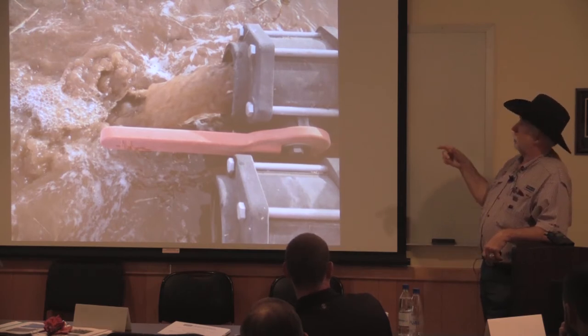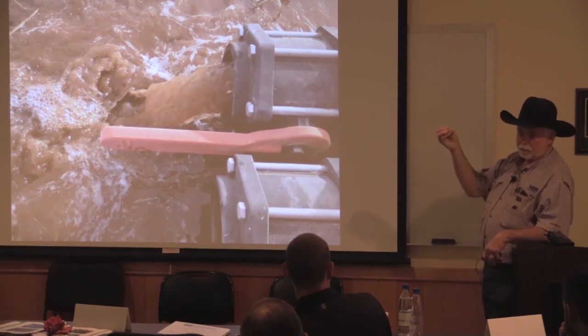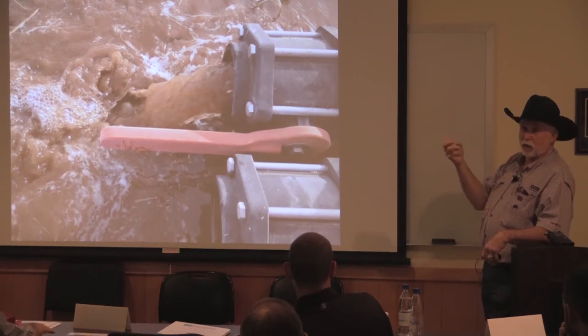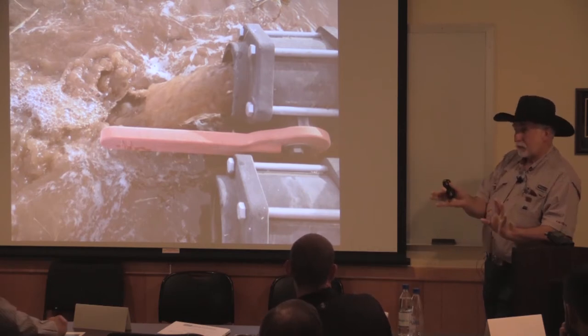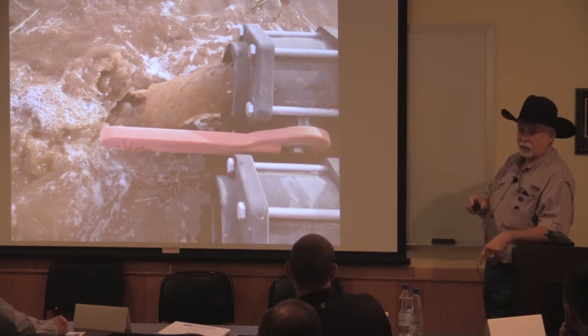But what'll kill you is if you let that stuff build up till it starts to make globs, or if you put the wrong chemical or chemicals that cause that to bond together and make mud balls, that can stop you up. The good news is if it stops up on that side of the dripper, it's easier to clean than if it's on the coming in the other side, because that's the high pressure side.